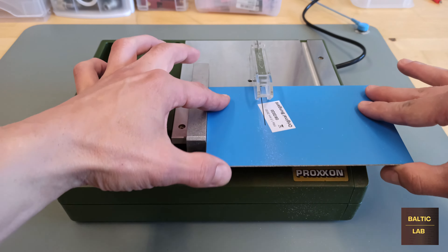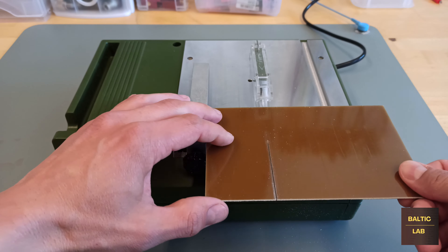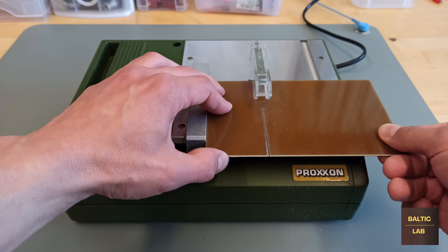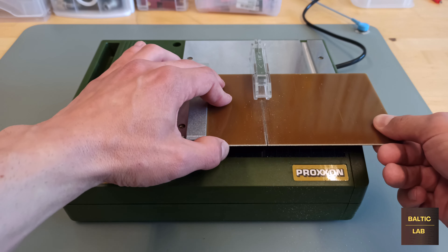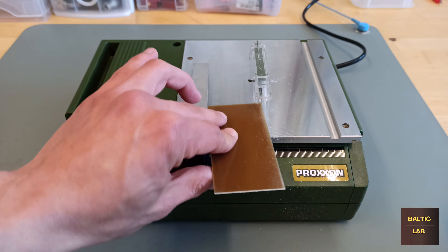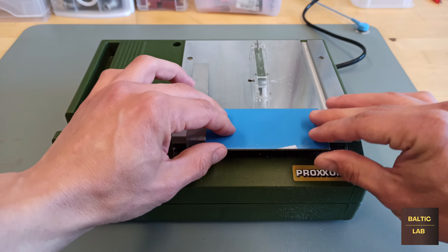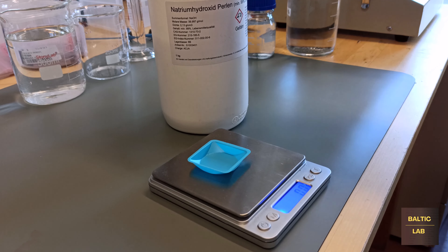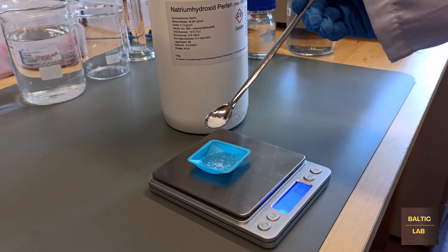To make the design process a little bit easier I tend to use some standard sizes — for instance 50 by 50 millimeters or 100 by 50 millimeters. I usually have some stock material cut to those sizes available, but if I need anything special I'll just cut it up real quick. To bridge the time required for the printed PCB layout to dry, I like to prepare the developer and the etchant.